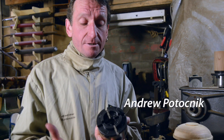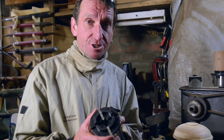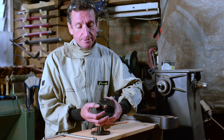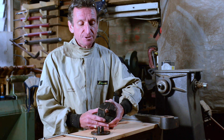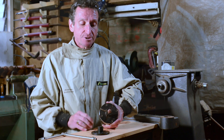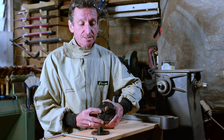If you find that your project requires more specific jaws, there's a range available that will fit these chucks. If you're looking to work on smaller pieces of timber, such as this one here, which is only about 12mm by 12mm, you can use some of these jaws which will close down quite significantly and be able to grip onto those small, thin pieces of wood.